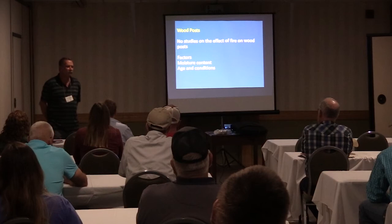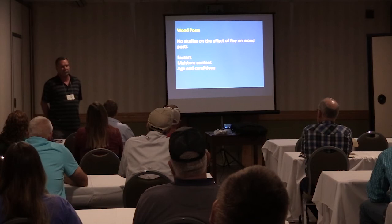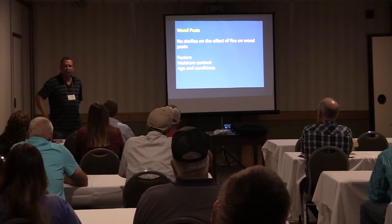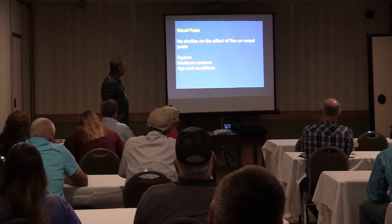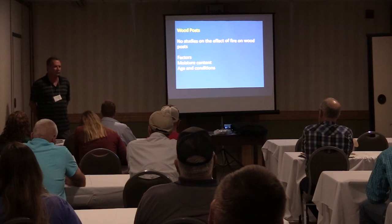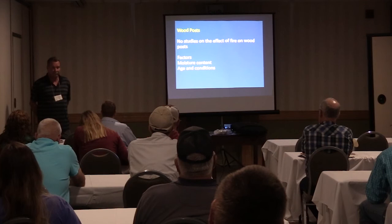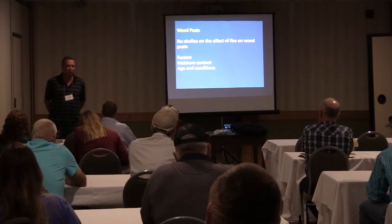That wooden-stay case is something we don't see with normal prescribed fire use around fences, and it was a scene where you could see that was the cause. A lot of times in wildfire situations people will say, look at that fence — the wire's all broke. Well, the wire's broke inside a cedar tree. There's a bunch of trees in the fence and two or three wires broke. Yeah, that wire got broke four years ago — it wasn't because of the fire, it was because of the tree. Wood posts: I don't really have a lot of concern. If you're worried, wet down corner posts and things like that, but for most line posts it's all about soil moisture. If you're burning when it's really dry, yeah, be concerned. If you've got good adequate soil moisture, probably not a whole lot to worry about.